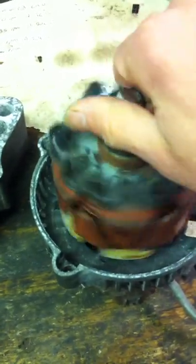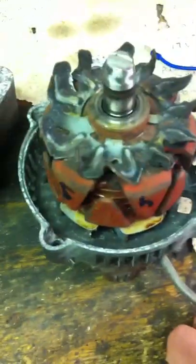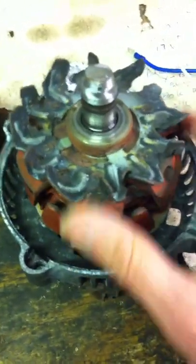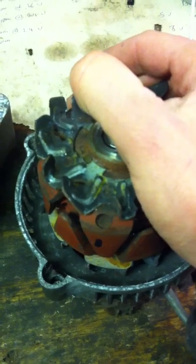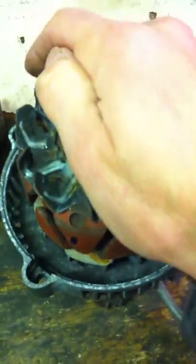I think I'm going to experiment more with putting more field on and seeing what sort of mileage I get, rather than messing about with trying to modify this with permanent magnets. At the end of the day, it's simple with the electromagnet — and it's only a couple of hundred watts. I've managed to get 40 miles an hour out of this bike, so it's pretty good before it's a proper motorcycle.